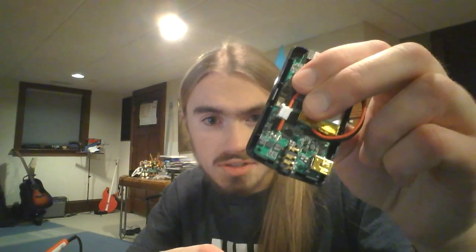So, battery fault confirmed. Just today the new battery came in. I desoldered the old battery, spliced on a couple of wires onto the solder pads — it's solid core wire, so I can just stick them into the connector that came on this battery without having to remove that connector, which is nice. I can reuse this for some other tasks later. It works now — it's pretty great.